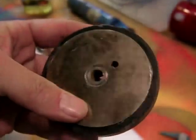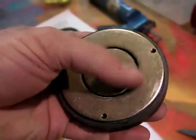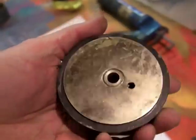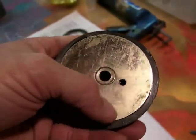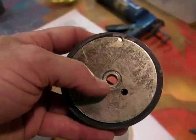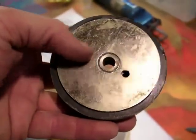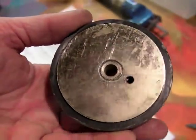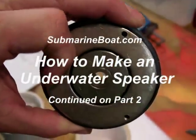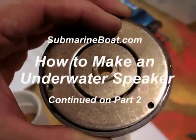This is what we've ended up with. There's that ring where the diaphragm sits down in there, and now there's a hole through the back that goes into where that is — a small one on the side and the main one here. Actually, when I got to drilling on that main hole, it just had a bushing piece in there that kind of pressed out — I converted it into a whole bunch of shavings before I figured that out. Next time I'll know.